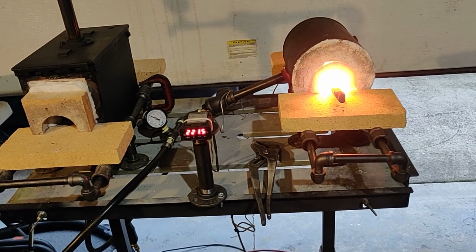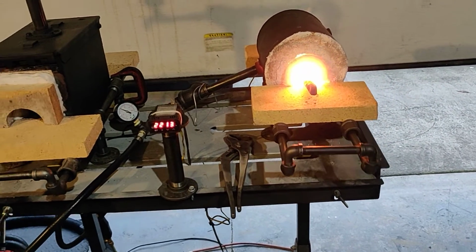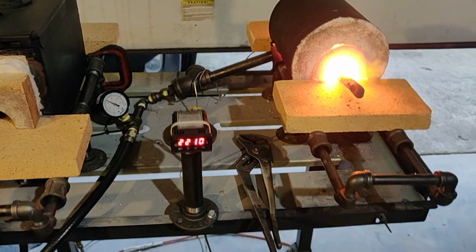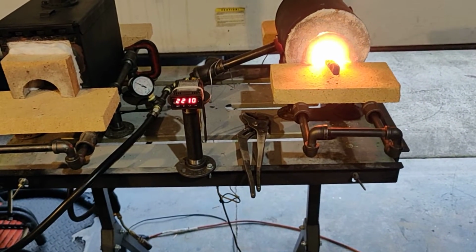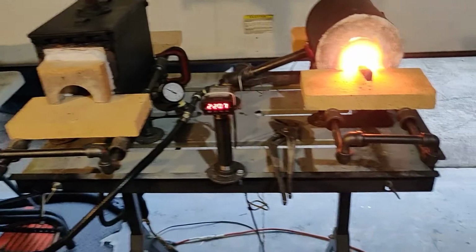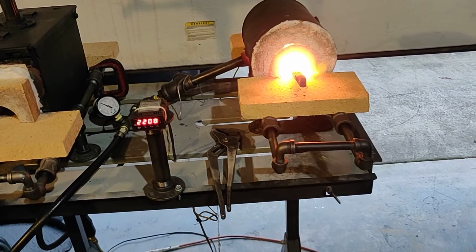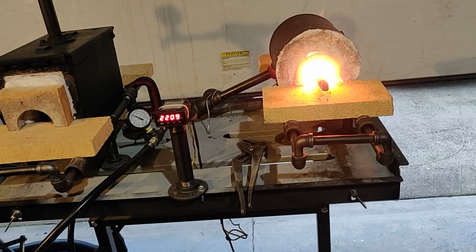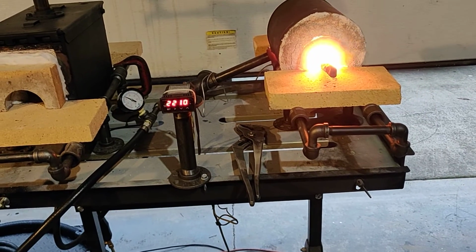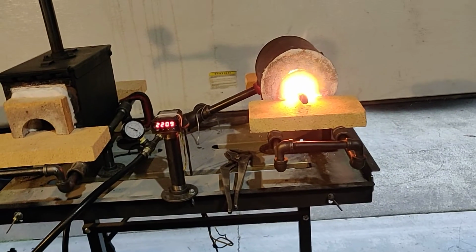Thanks for watching, and you see our temperature is over 2200 now at 6 psi, and I think I mentioned that is a 0.025 gas orifice tip delivering the fuel. So you can do the math on that to find out exactly how efficient or how long a standard barbecue size tank will last, as long as you know the fuel pressure and the gas orifice size. I can tell you though, it's super efficient, and you get about as much heat out of this little paint can forge as you want.